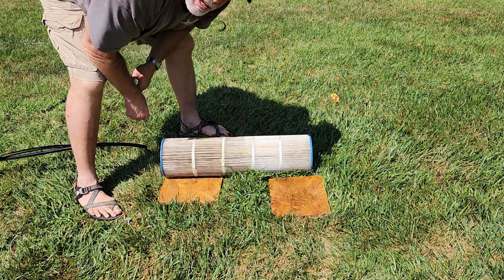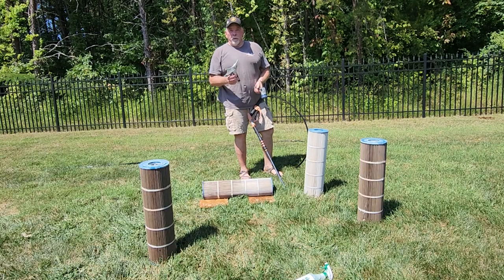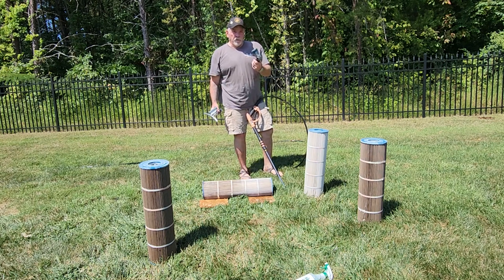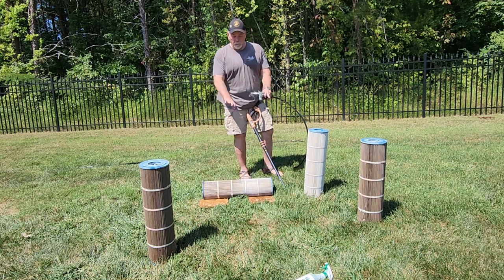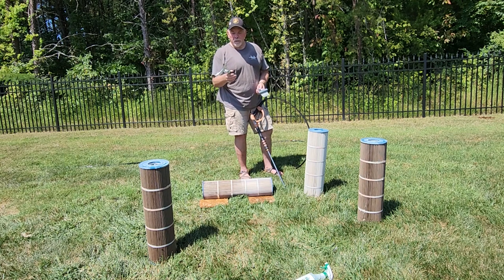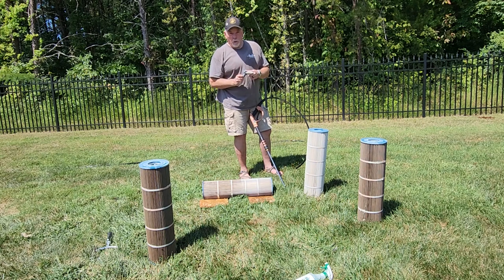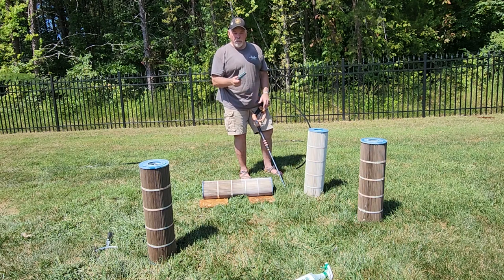The soap nozzle in 30 seconds also did pretty well, but not quite as well as the pressure nozzle. So here are the results of the four different ways of cleaning cartridge filters. The garden hose sprayer with the jet setting works pretty good — I've been using that for a while. The Filter Flosser works okay but it needs to be redesigned — there's not enough pressure. Honestly, unless you just like the ergonomics, I wouldn't get one of those. The Aquacomb works pretty well, better than the garden sprayer, but it only cleans a little section at a time and doesn't get around the bands very well. I'll put a link to both of those in the description.